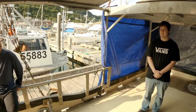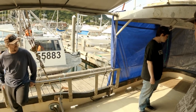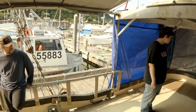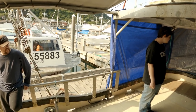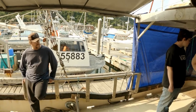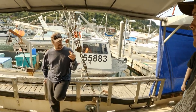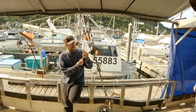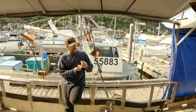Just a little bit of touch up, like we say. And seal that hatch down. I guess I need to weld a couple of tabs to the bottom of it so we can tighten it down. That shouldn't be too big of a chore, I don't think. So what we did on the fishtail is on the hatch ring itself, we welded some threaded plugs on the bottom of it, and then the bolt can come up through the plywood right there and suck it down.